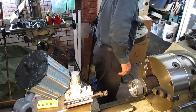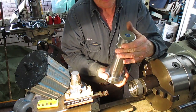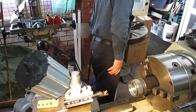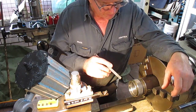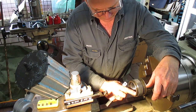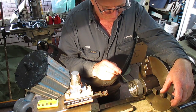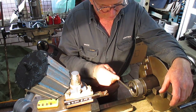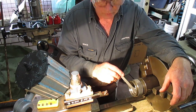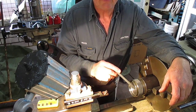I made up the pin with a 64mm thread and everything and now I've completed the nut. Because this has to be very accurate, all of these facets here must be quite accurate. So it normally would machine and bore it, cut it off, machine the back and then do the thread. In this case I opted to do the thread first because I wanted that to be running true and save another setup.